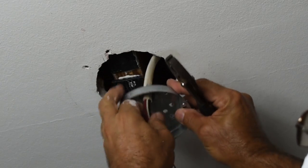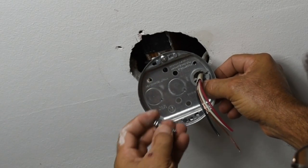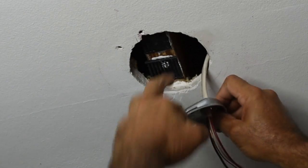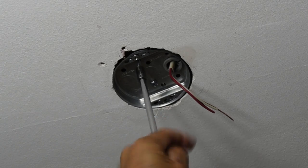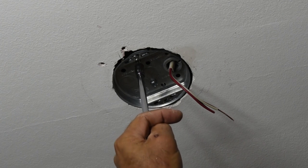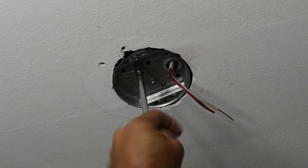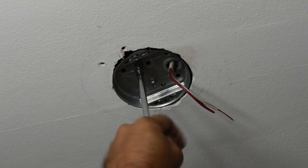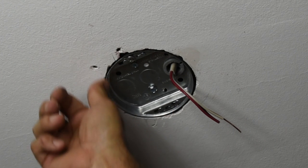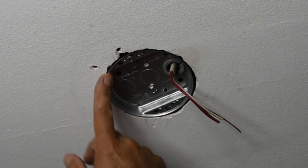There you have it — you can't pull any more cable down. The next thing I'm going to do is drill a hole here and there to insert these bolts, about an inch and three-eighths to an inch and a half long, going straight through into that 2x6. Two bolts are more than sufficient to hold up a fan. If you're using a Hunter fan that's cast iron, I'd put at least three. But most fans are not going to be cast iron, and I believe just two of these alone would definitely hold up a cast iron Hunter fan. Solid and flush — that's what you want. If I didn't put the shims, one side would be in about an eighth and the other side would be sticking out about an eighth. By using the shims — perfectly flat. When I put the bracket on, it'll stop pushing against the ceiling as soon as it touches that metal edge.